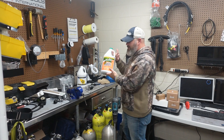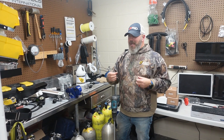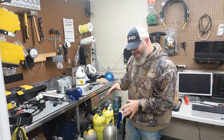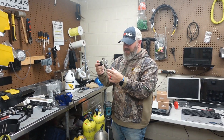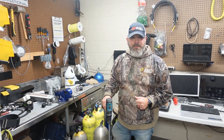When I go to clean the cylinder and the valve, I'll put gloves on first. I can clean the valve the same way using the soapy solution, or put it in an ultrasonic cleaner. There are many cleaning solutions we use - sometimes a Simple Green and water mixture, sometimes Blue Gold, or even Dawn dish detergent and water. Dawn is a great degreaser, and that's exactly what we're trying to do - degrease those hydrocarbons. Inside the cylinder I use hot tap water and Dawn. Once cleaned, we flush with fresh clean water and then dry the cylinders thoroughly.